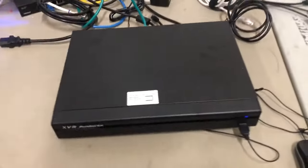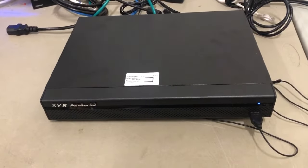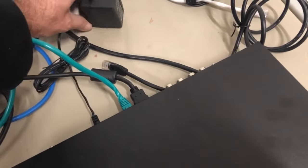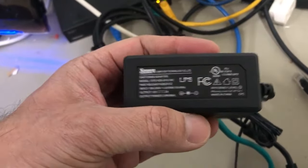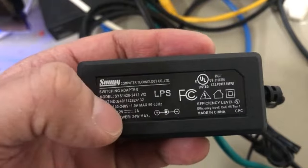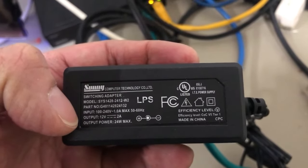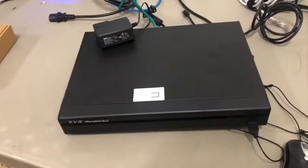Hopefully this helps you understand why a DVR will not work and how to troubleshoot it. The last thing you can do is if the power supply that comes with it stops working after some time or happens to be a bad power supply, look at the output label — it says 12 volt, 2 amp, center positive DC. You have to use DC current. If you have another 12-volt supply of the same amperage, 2 amps or more, you can try to power the DVR and see if it turns on. Thanks for watching.